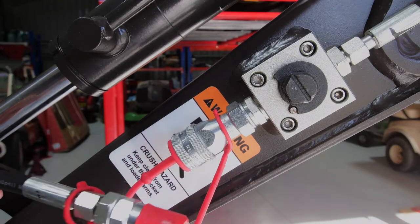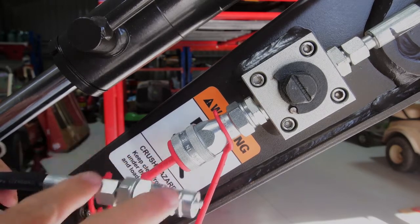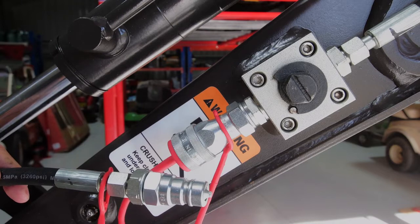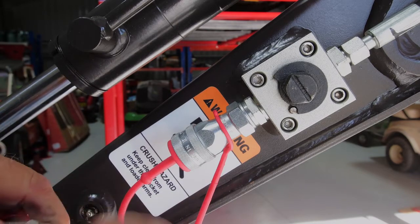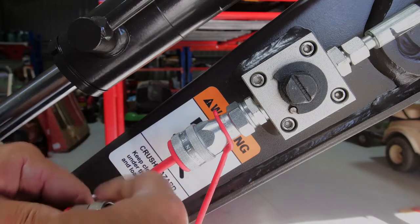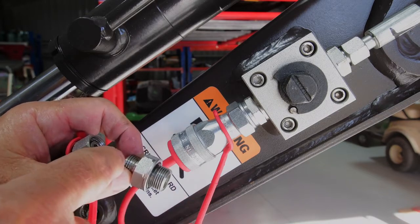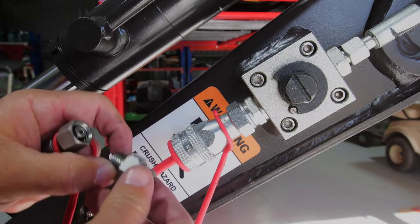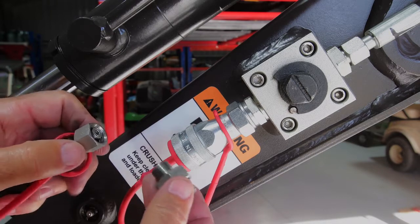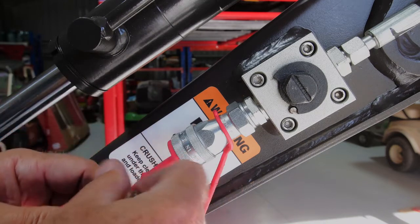If you have another attachment — in my case I've got an auger drive — you've got two pipes from the auger drive motor, one to each side. For my tilting bucket, I would need to buy another two male connectors and another two nipple couplers that have BSPP on one side and 8 metric light on the other side. These weren't very common — when I went to the hydraulic shop they don't do a lot of them, so I had to get them to order two in for my tilting mud bucket.